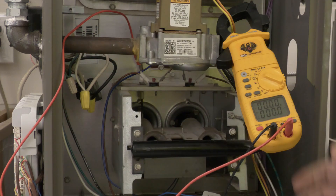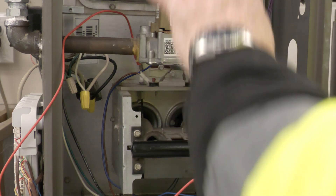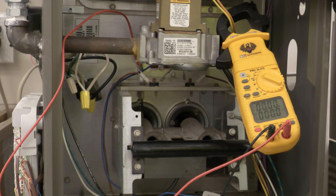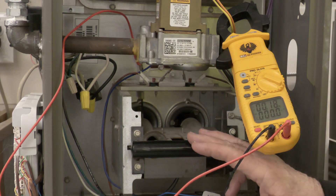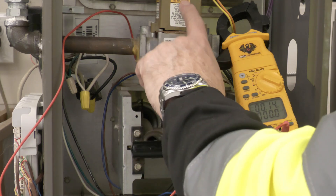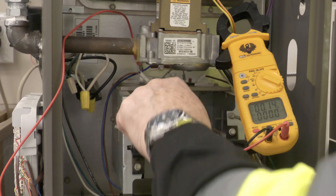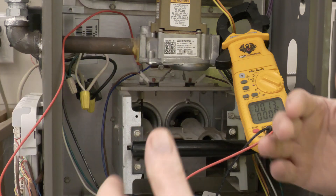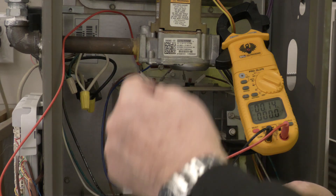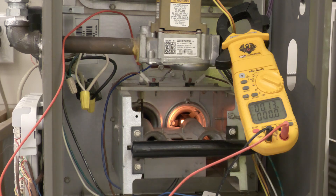Once it's set, we're going to run it into a cycle. I'm just going to turn the heat on real quick. This will go through a purge cycle — the fan will come on, run for a few seconds to purge any gases, and then it's going to heat up the hot surface igniter. The burners will light directly off of the hot surface igniter. The gas valve will open up, the flame will shoot across, and the flame sensor is on the last burner. It will sense the flame and continue to leave the gas valve open. If it doesn't sense flame, it'll stop.